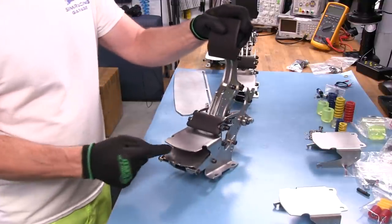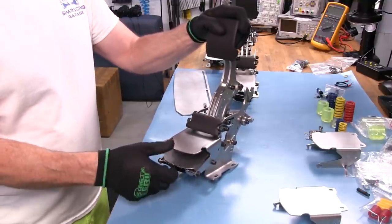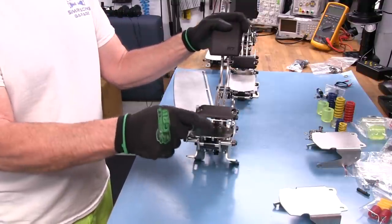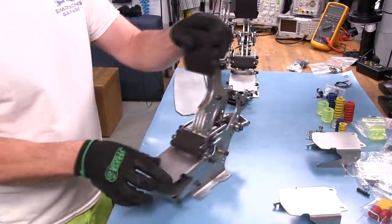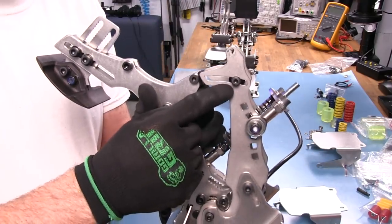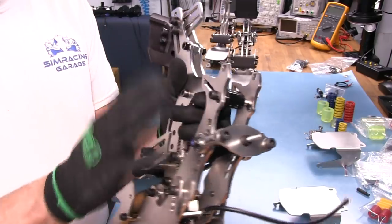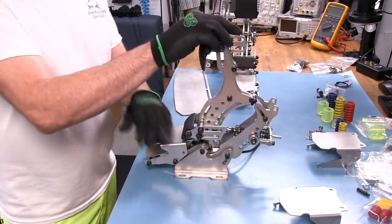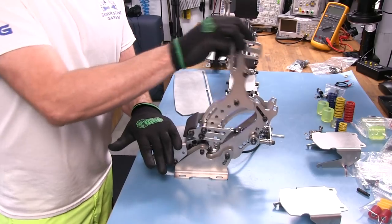Now also, because of the range of motion here, I didn't want this hitting the bottom, because it will make a metallic noise when this taps the bottom here. So I did have to adjust my stop here for the throw by about 5 millimeters. It wasn't that far, but it would make a clanking noise if I didn't do that. So now it's as quiet as it was before.